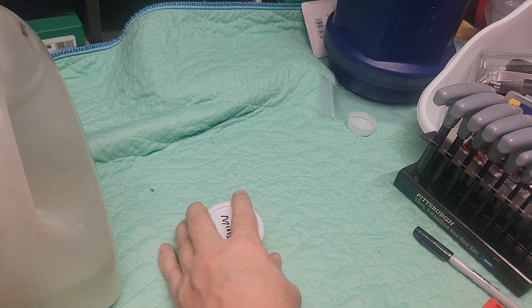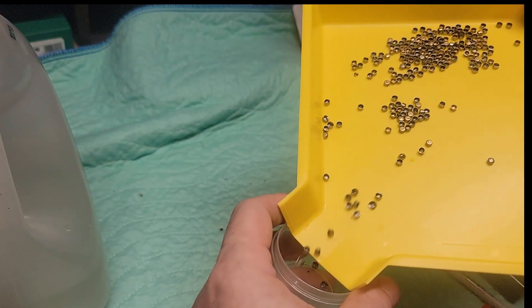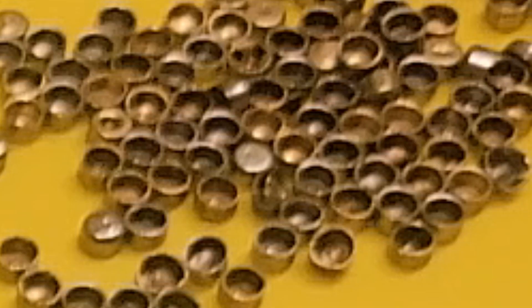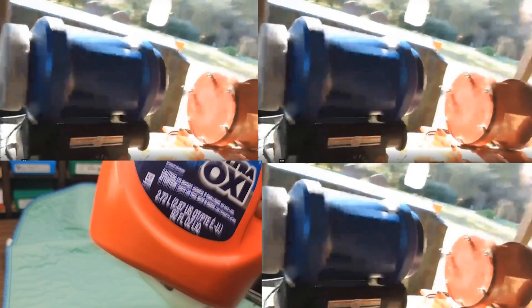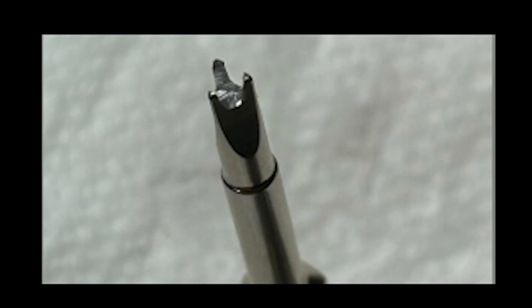We're not quite through with this batch of cups. You'll see a big difference in the percentage of de-anviled cups — probably 80 to 90%. But that last 10 to 20% will probably have to be manually processed. Because it's so efficient at removing the anvils with no visible damage to the cups, I recommend you follow a wet wash or two with one session of shake and bake, and then use your danvils to de-anvil your primers manually. Danvils will be the subject of an upcoming video.